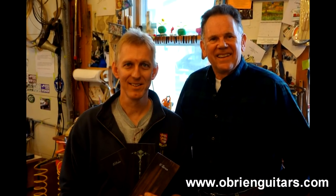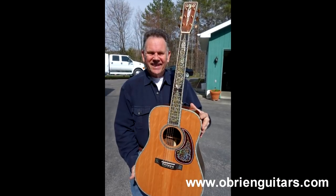That creates a problem for inlay work. Most of the things we're going to inlay into the surface are thicker than 1/64th, so you would have to route the channel twice — which could create extra work and problems. Recently, I visited David Nichols from Custom Pearl Inlay at his shop in upstate New York, and I learned a thing or two about how not to break bits.